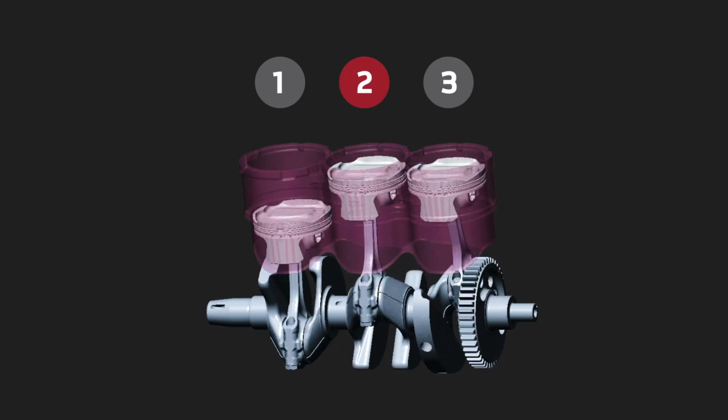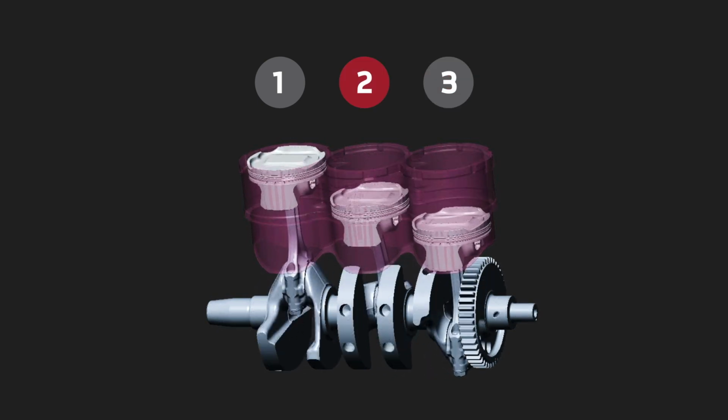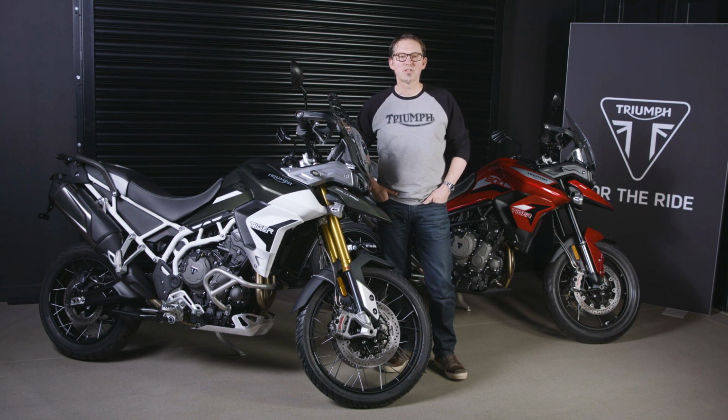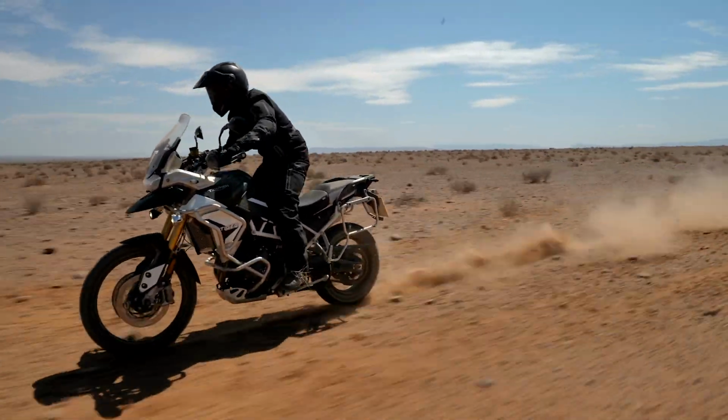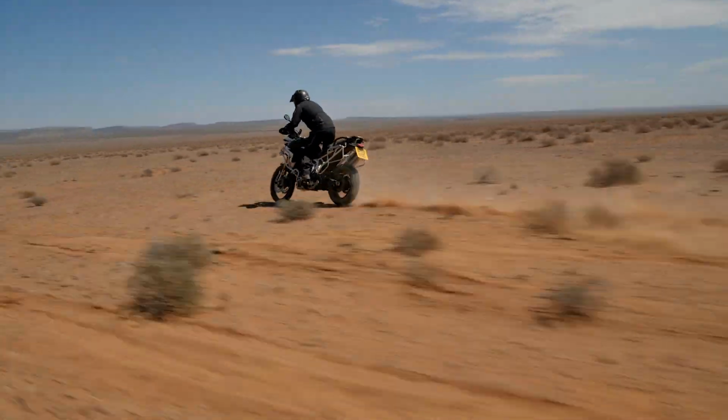The combination of larger engine capacity, firing order, more crank inertia and a responsive engine tune give an engine that feels and sounds great at low RPM and really encourages use of all that torque at the bottom end of the rev range. The character of the engine and the connection you feel with the rear wheel through the throttle is what we were after.